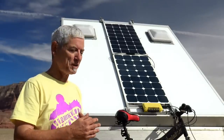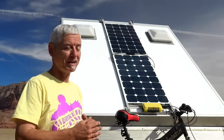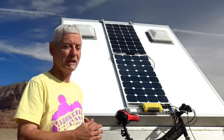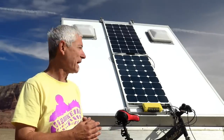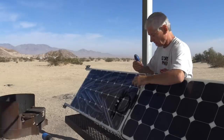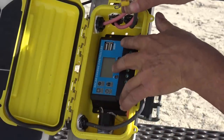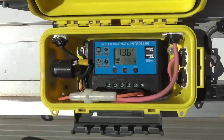As mentioned in some of my other videos, one of my panels failed and I had to replace it, and I'm not really happy with that. A solar panel — I don't care what type it was — should not fail after just two years. I've done a little bit of research and I'm going to be talking to some manufacturers to find out why that happens, because when you're depending on solar energy while traveling, failure is not an option. I took this opportunity to make another improvement, switching out the old 10 amp controller with a new 20 amp one. The new panel was much more efficient — the old one never peaked beyond eight amps combined. It's good to see these panels are improving in efficiency.